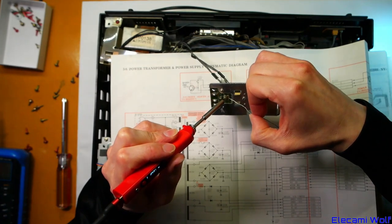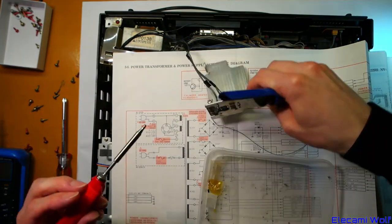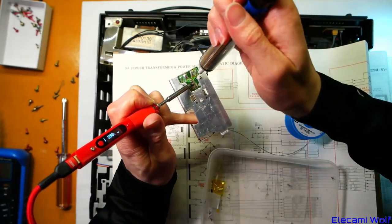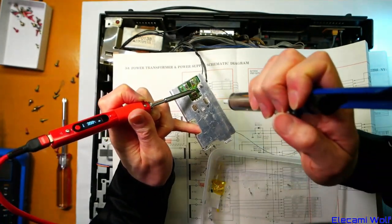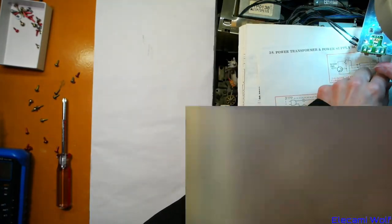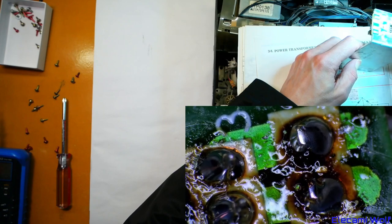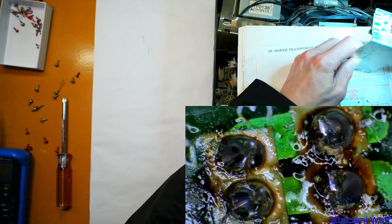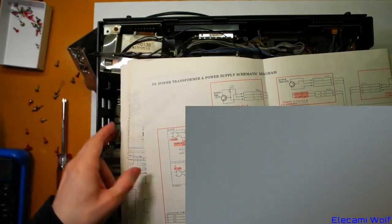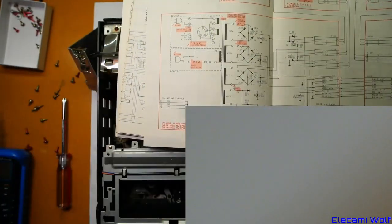I like to pour flux all over everything these days. You get good quality solder with flux in it, then you normally don't need any more. We've just got to get a bit of wick or a de-solder pump — a short tip comes in handy so you can hold stuff close enough without burning your fingers. That cleared it up — there's lots of juicy flux in there now. It's all crusty but pretty sure that's soldered now — probably some original old-school flux from the original soldering, but it's actually joined.